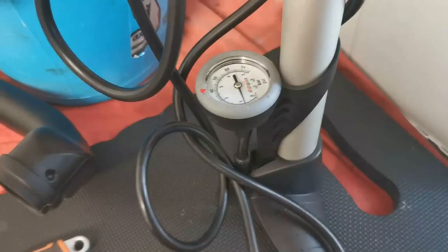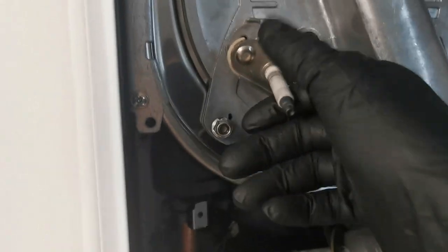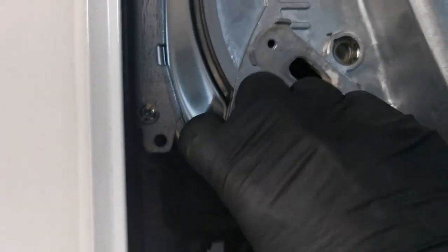You want to remove the electrode. I recommend you carry the electrode gaskets and the burner gaskets on board, as chances are they are going to perish and you're going to need to replace them. Remove the nuts holding the burner in and the screws connecting it to the fan.